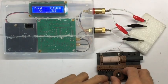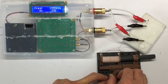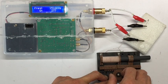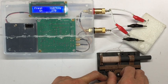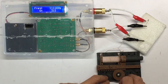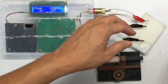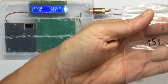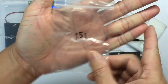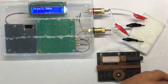Next let's test the straight variometer using the ferrite rod with a special material called R40C1, manufactured in China. It goes from a very high Q-factor of around 310 down to around 275. So it's much better than the ferrite ring. That was using the high-band 150 pF paired capacitor — the same type of SMD high-Q 10,000 Q fixed capacitor.